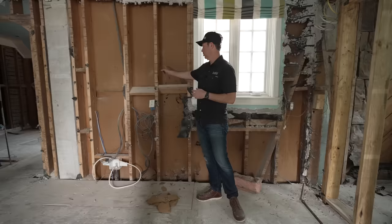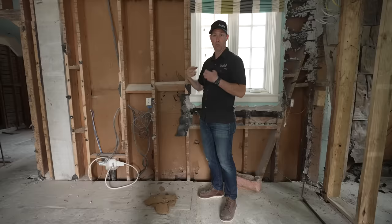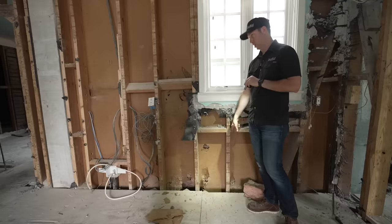Mold in particular tends to happen on cellulose — that's a fiber, a wood product, that's food for mold — and it tends to happen on wood that's more broken down. You would rarely see mold growth on the side of a two-by-four, but you sometimes see it on the back of sheetrock or other more broken-down materials like paper. This wood fiber is more broken down than a two-by-four. I might expect to see, if there is some water in this cavity, mold growing on the back of this broken-down wood product.